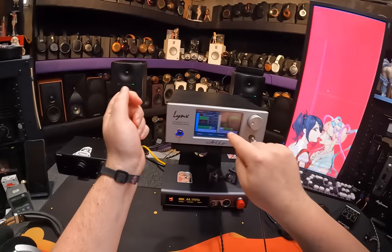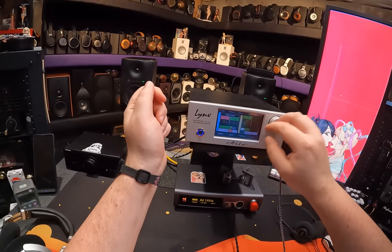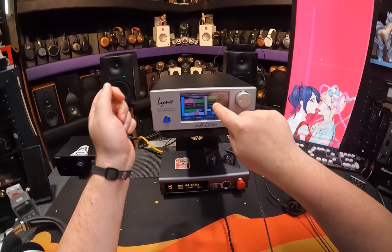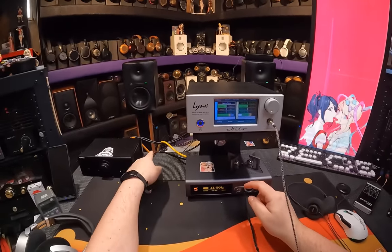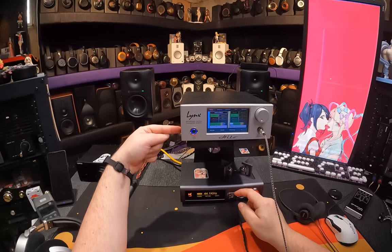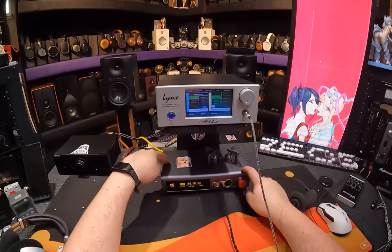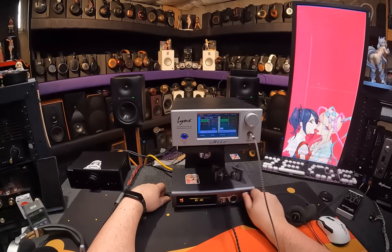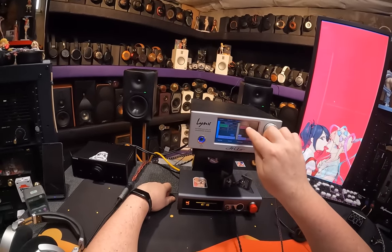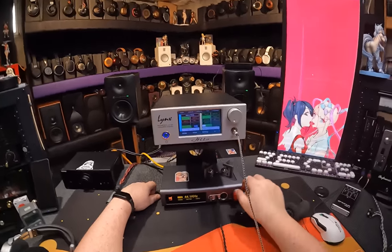You can just touch the screen also, and you can do line out and touch the screen. So, and the phones are playing, everything's playing. So now I'm taking an analog input, putting it in this box, it's converting it to digital, pushing it out through S/PDIF coaxial into this unit, and this thing's DAC is reevaluating it and pushing it back out. That is a thing. I've muted that now because I touched it twice.